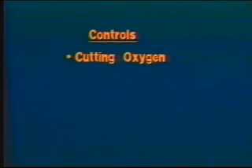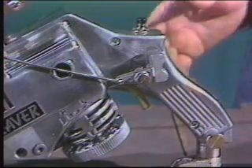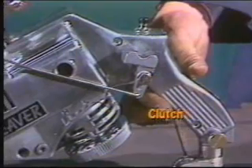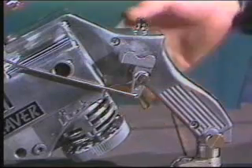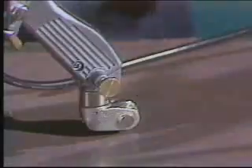With the cutting oxygen, clutch, speed control and on-off switch conveniently grouped around its pistol handle, the Beaver can also cut profiles and curves and, with the optional radius bar, circles. By changing the location of the pivoting wheel, you can cut extremely tight radii.